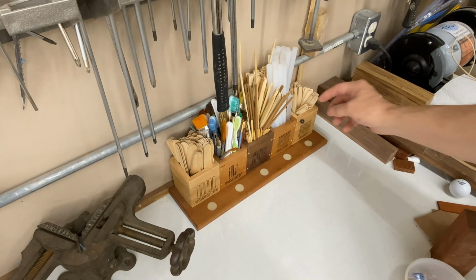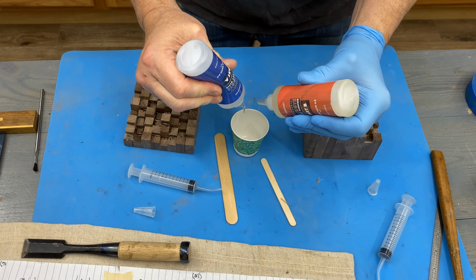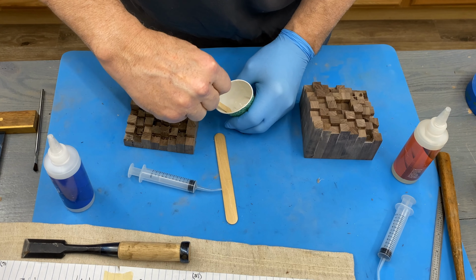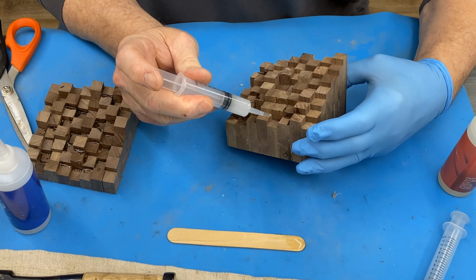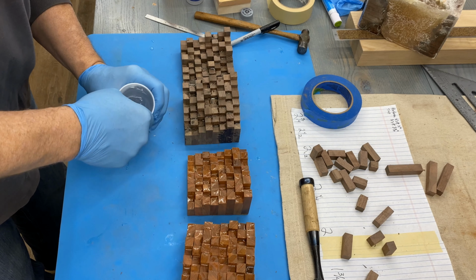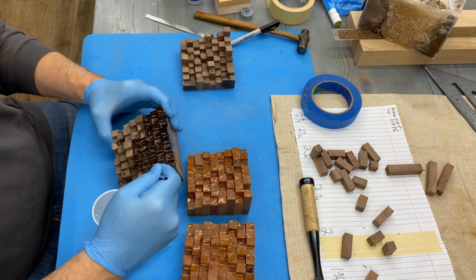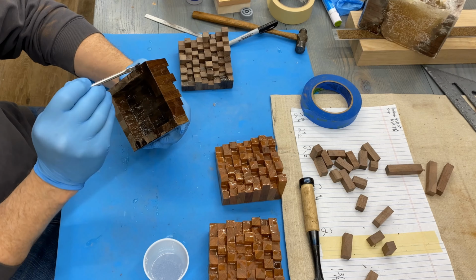There's no point in showing the rebuild of the walnut blocks, but it followed the same basic design as the first epoxy disaster. In order to help eliminate the possibility of stray bubbles forming during the next pour, I decided to seal up any cracks or tiny gaps between the blocks with some thicker epoxy and a boat-building epoxy syringe. After that initial application had cured, I followed that up by brushing on some of the new clear craft epoxy to cover all the end grain on the top and the bottom pieces, including inside the battery box chamber.